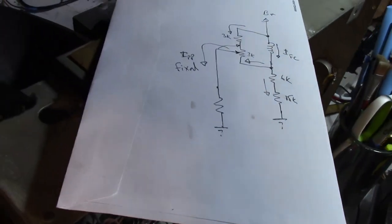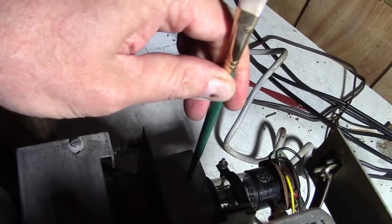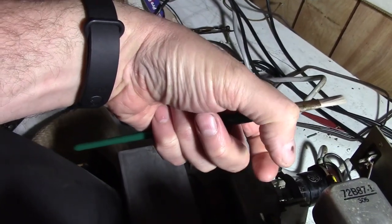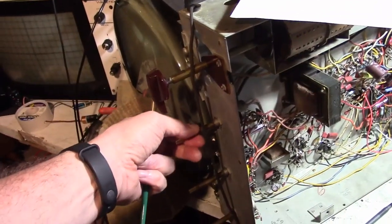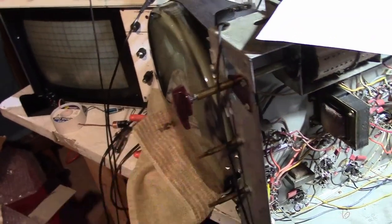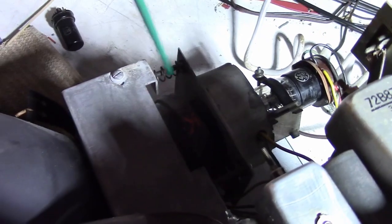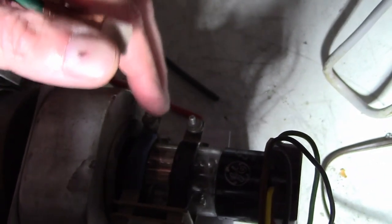The last real issue is focus. This is a focus coil — it's an electromagnet around the neck of the CRT. You can think of it as a magnetic field that squeezes the electron beam into a tightly focused beam going to the front of the screen. It's not working so well; I've got the focus control all the way to one extreme to get it kind of good. It's almost there, but I'd really like it to be best when it's in the center of its rotation. There are physical adjustments mainly for centering the screen — a screw and a spring on every corner — and it seems better focused when I move it back, but it's about as far back as it can go before hitting the ion trap magnet assembly.